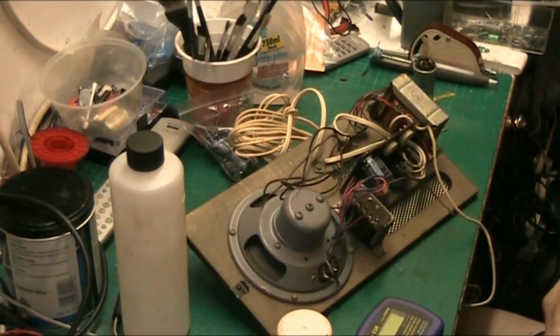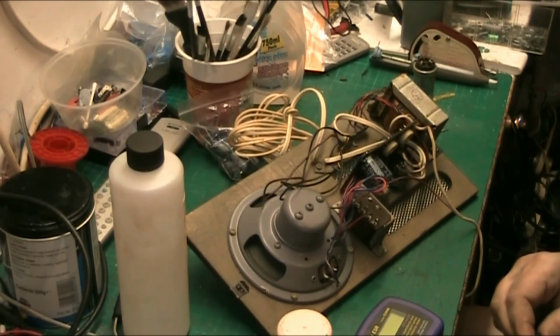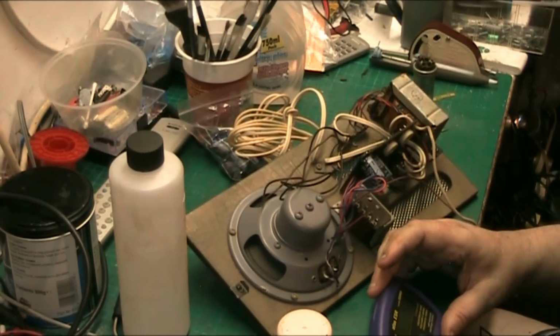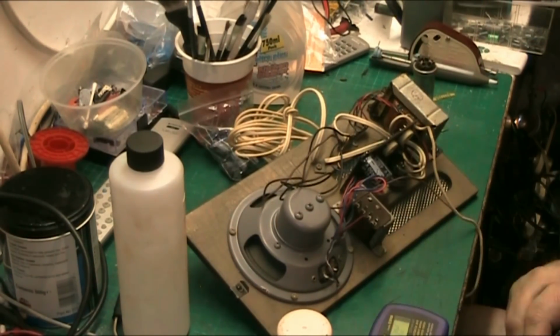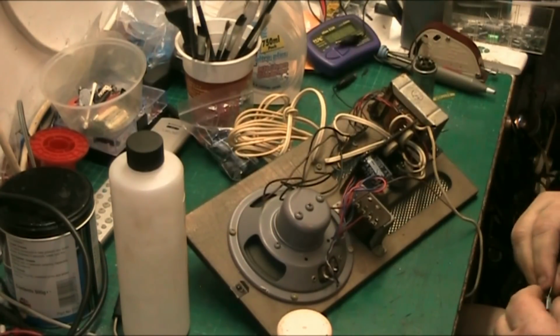Let's see what it actually says it is. We also need a 0.5 UF as well. It's 46.8, just under 47, and it's 0.76 ohms. That's good enough. Certainly better than what was taken out of there. That should improve the amplifier.